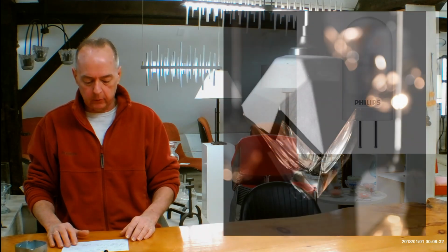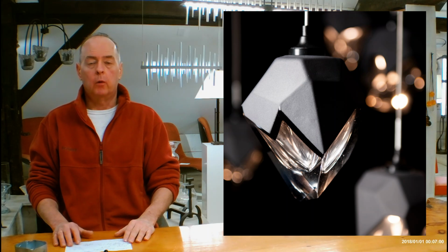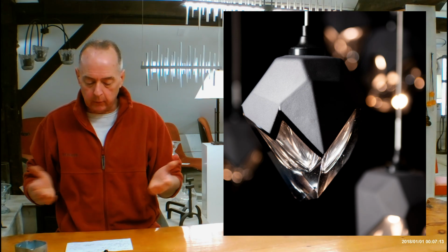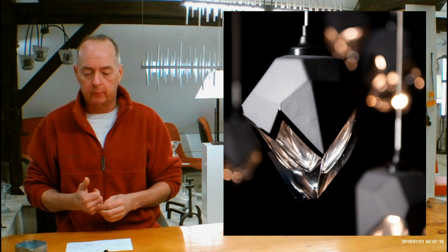They're going to offer these bulbs to you in different ways. They're going to offer them to you in 2700 Kelvin, which could be very pretty in this. That's going to be a very yellow light. But they also offer these to you in something called daylight, which you should be very careful about because that sounds like it should be a warm light like sunlight, but it's not. That's going to be cold, kind of outdoor overcast day, or like a convenience store light. That's like that bluish white light. That's 4000, 5000 Kelvin. You'll notice that on the page. What we like to use in our showroom is warm white or soft white, and they'll spell it right out there, and it's 3000 Kelvin. That's the light coming down from these above me, these LEDs, onto this nice table. So that mimics a nice glow of an incandescent bulb we grew up with, so that's why we like that.